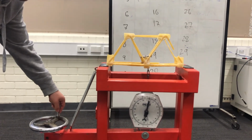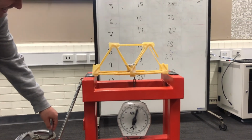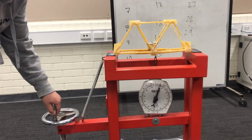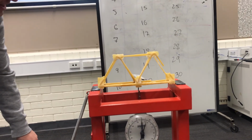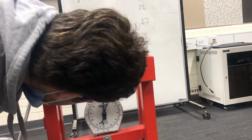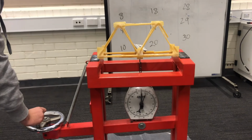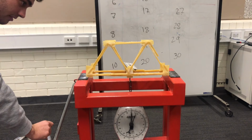Reflecting on the process, we can agree that our bridge had many areas of weakness. However, it could have been tested further until proper failure. If our bridge was constructed to length, we estimate it would have more leverage against the load being applied and therefore would be stronger. Additionally, it appeared that the smaller sized members worked more effectively in bearing the load as there was less compression force being applied. However, our bridge was strengthened by thickened members and gang nail plates, and to further strengthen these pieces, additional superglue was applied.